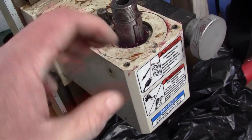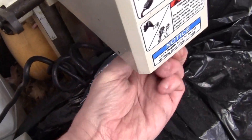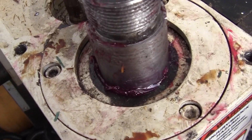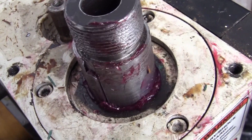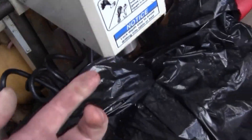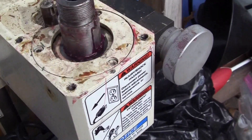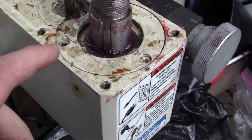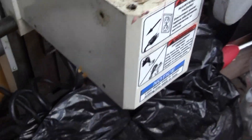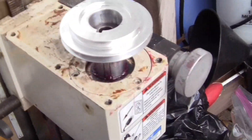I didn't like the way it felt when I turned the pulley — it was a little gravelly. So I went and took it back apart and re-greased those bearings. And I'll tell you what, it's feathered now and there's no play. We'll do a run-out test when we get it all together, of course. Now you get a good look at that shim I made — I had to make a fatter key. Things fit together really well. We are going to do this, because they said I couldn't.